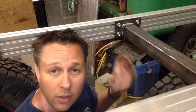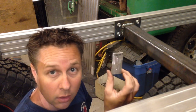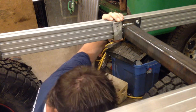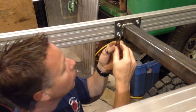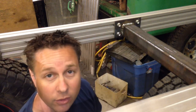When it comes time to mount your own stuff to the T-slot, you need to make yourself a small jig. This jig is drilled out on the centers of the slots so that when I place the jig onto the steel, take my center punch through the hole, and then drill out the hole to the size of the bolt, everything lines up with the centers of the tracks for a nice easy fit. Using T-slot extrusion and some simple pieces of angle also makes it very easy to make rigid, strong, and square structures.